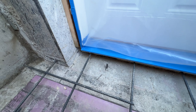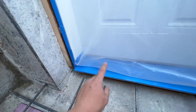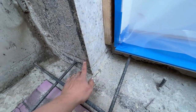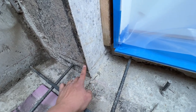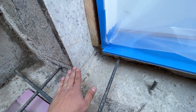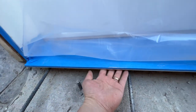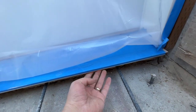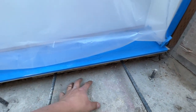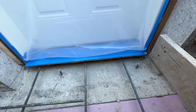The other thing I want to talk about today is the way this slab is going to come in here and meet up with the existing slab inside on the other side of this door in the basement. Here we have our mark where the top of the concrete floor is going to be — that corresponds with the inside one, and it slopes down this way slightly. This concrete pour is going to flow underneath here and fill in underneath this threshold so that it's nice and tight and solid. It's also going to be tied in with all this rebar, so it won't crack, and it'll be resting on this original footing — really solid. That'll give it a nice seamless transition from the addition into the existing old space.